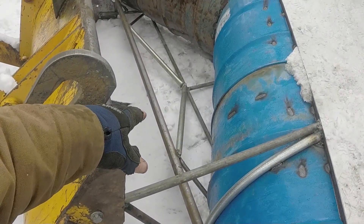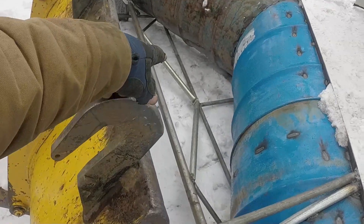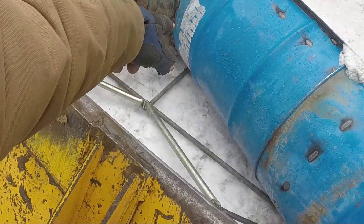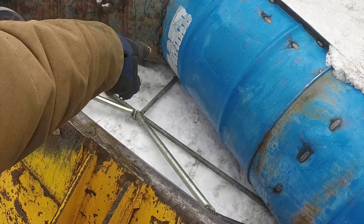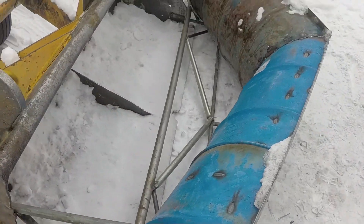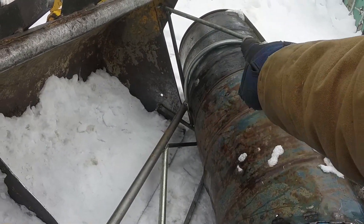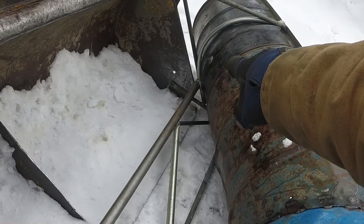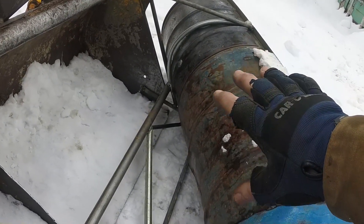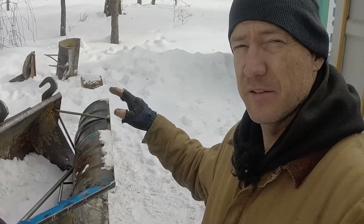Here's a little view from the back side. I've got two bars going all the way across and a little triangle ladder for support. I tried to put triangles about everywhere I could. I've got another cross bar going to the nose down on the bottom to support that — that makes two triangles up front, and then all the triangles coming across that little ladder there. And then we've got the two bars, top and bottom, that bolt to the bucket, and the little hoop and the diagonal that goes between those two bars. It kind of ties it all together over there in the corner. This thing is pretty solid. I am fairly confident in the structure of this plow — it doesn't have any movement from me pushing or pulling on it, and doesn't have a lot of weak spots.